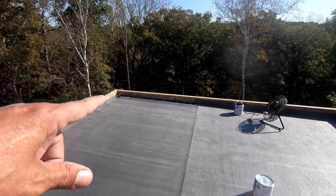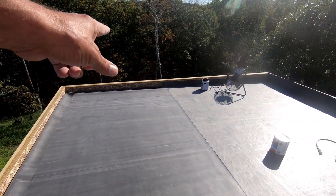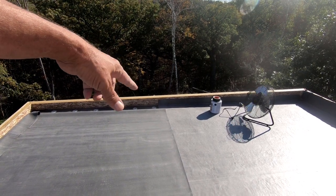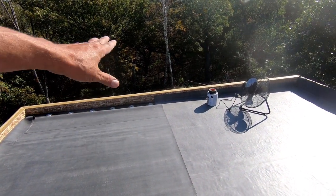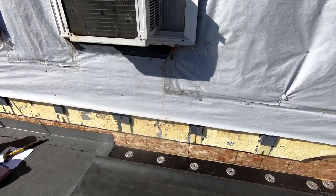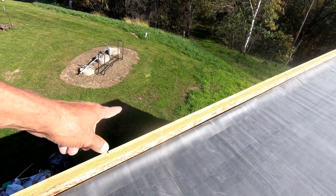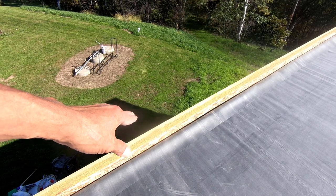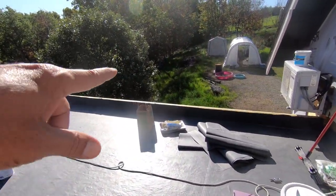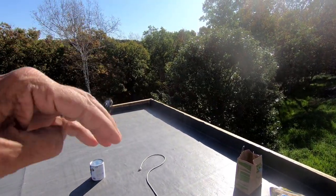I have my second piece of rubber unrolled and cut to size — cut to the right size this time. 16 inches plus the gap there, so that'll stick up a little more than 2 inches. Same thing here. And I think it's 6 inches here because that parapet wall is only 4 inches tall right there, so I don't want too much of an overhang. I actually trimmed it off right away on this side because all it's going to do is catch the wind and peel it back.